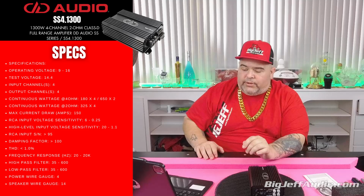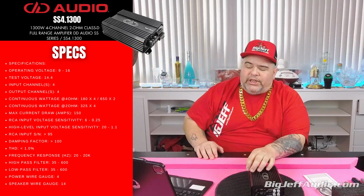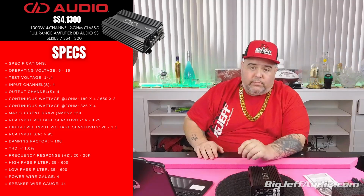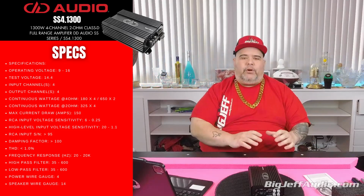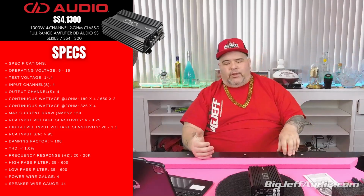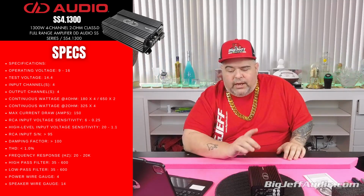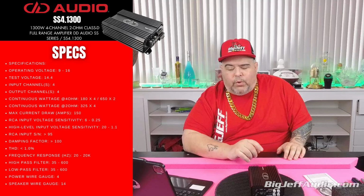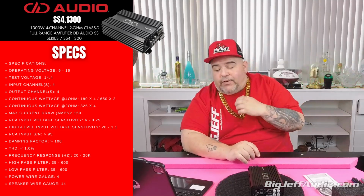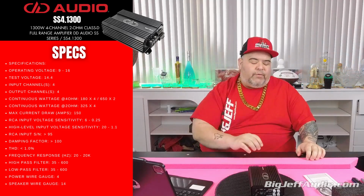Continuous ratings, that's RMS. At 4 ohms, 180 by 4 or 650 by 2. So you could almost run a small subwoofer on half of it and mids and highs on the other half, even at 4 ohm. But at 2 ohms, and again, you're not going to do a mono like 2 channel, 325 by 4. Max current rating is 150 amps. The input voltage is from 0.25 all the way up to 6 volts.